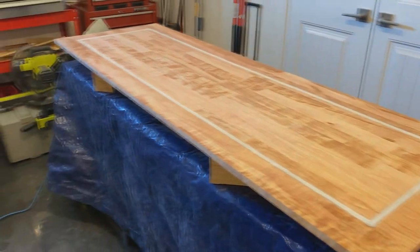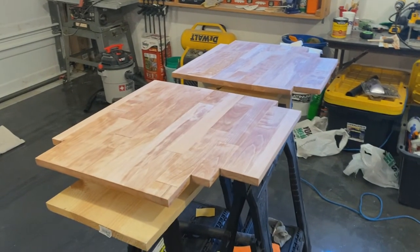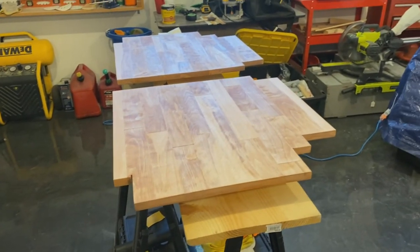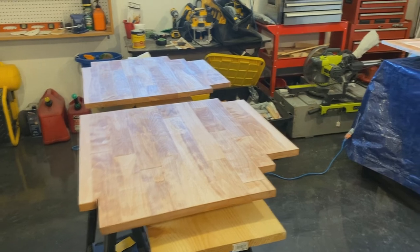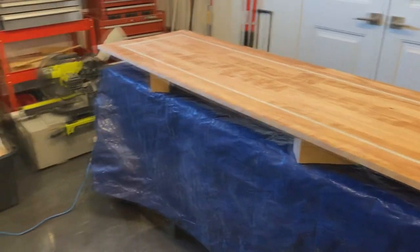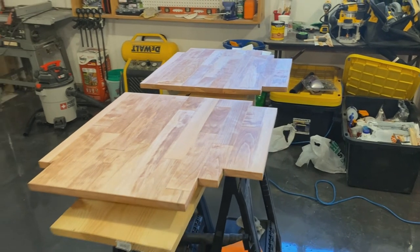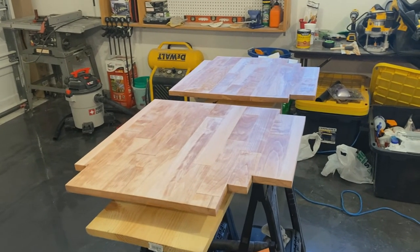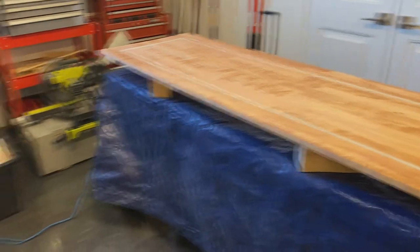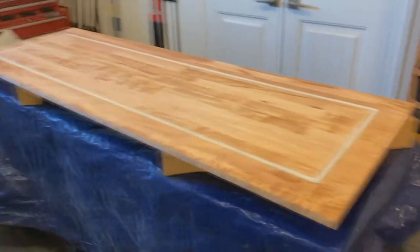So that's what I'm gonna do. I let this stain dry much longer than I've ever let it dry before, which is good. I found previously that if I just wait the 4 hours that stain recommends after you apply it, when you add that first layer of polyurethane, it kind of mixes in with the poly, and I don't love that. It's really not that big of a deal, but I just try to avoid it, so hopefully this works a little bit better. I think my poly already has some stain mixed into it from previous projects. But it's the same stain, this golden pecan, so it's not that big of a deal. But yeah, I think it came out really great.